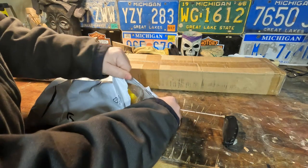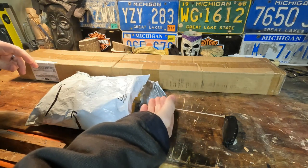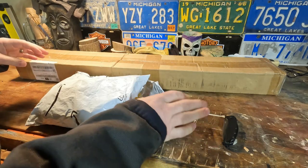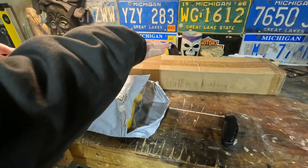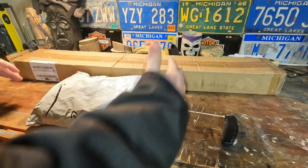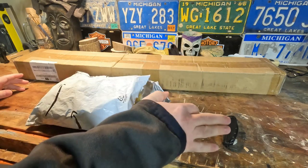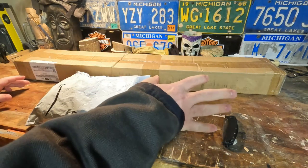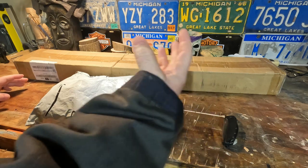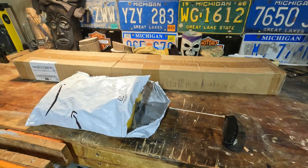So I noticed when I was cutting the logs originally, I was getting binding on the bar as I got deeper and deeper into the cut. And part of that was the unevenness of the log. But I think another part of it was just the weight of the slab pushing down on that cut.